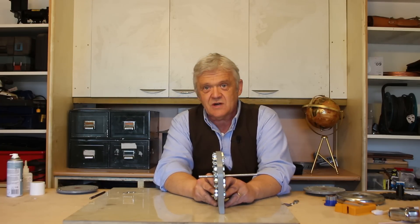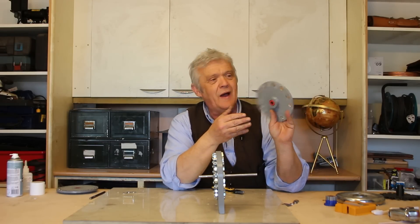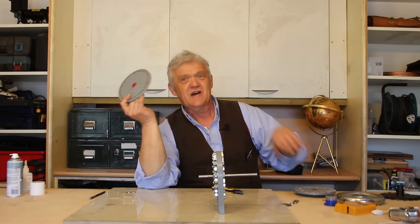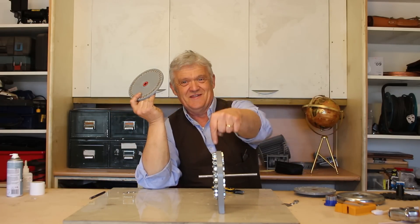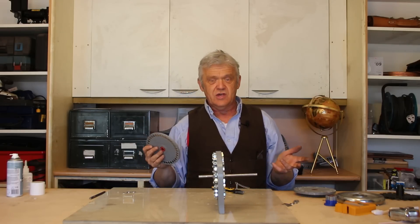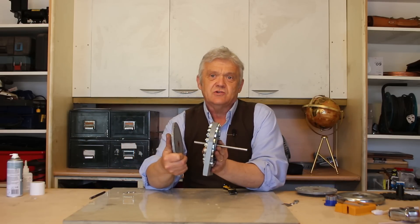I've done this in Tinkercad — the link is in the description. Once we've bolted on those 24 bolts, what we've got is the modulator for a magnetic gear, or directly part of a wind turbine. We need two magnetic rings: one with 12 magnets (6 pole pairs) and one with 36 magnets (18 pole pairs). 18 plus 6 equals 24, and 12 to 36 gives us a 3-to-1 gear ratio.